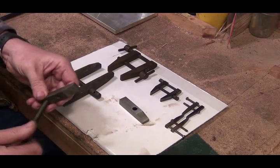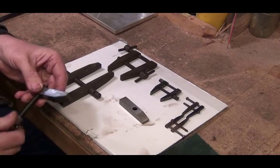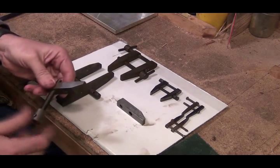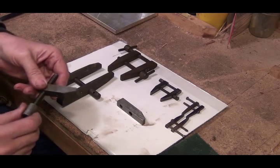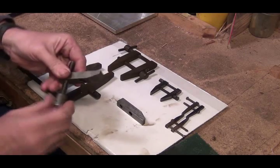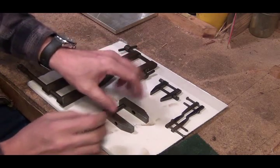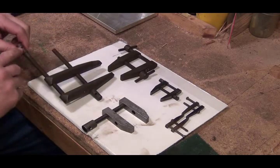They're used in machining. The jaws can be tightened down and they will be parallel with each other, and you can really grip stuff and hold stuff square the way you would want to as a machinist when you're machining things. The problem is they're knurled, but they didn't have this hole in them, and I just couldn't grip it tight enough to turn it, to get it tight enough on the material I was trying to mill. You see these other ones, they have holes already in them.